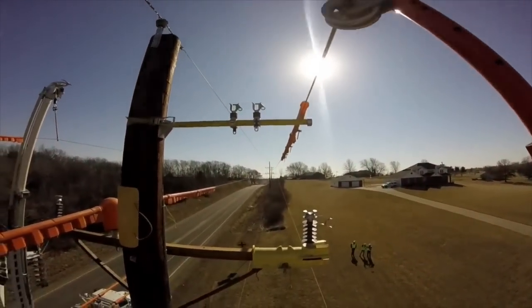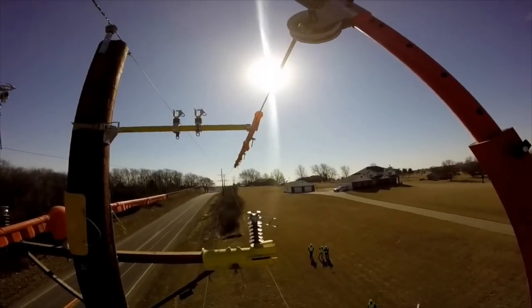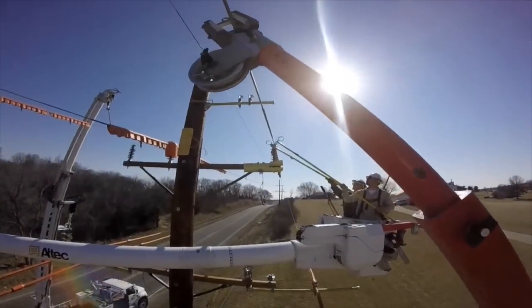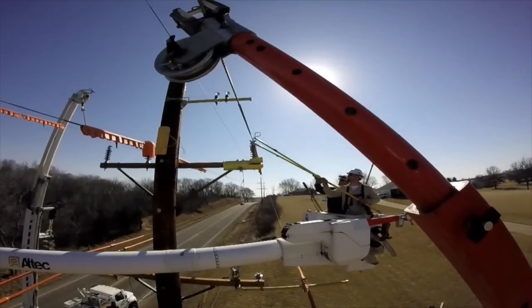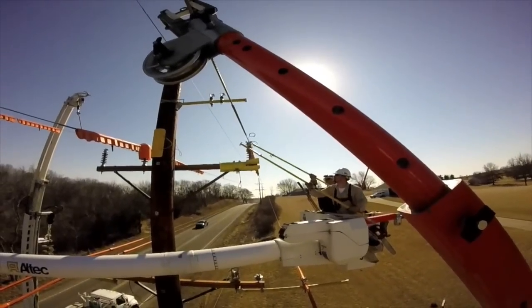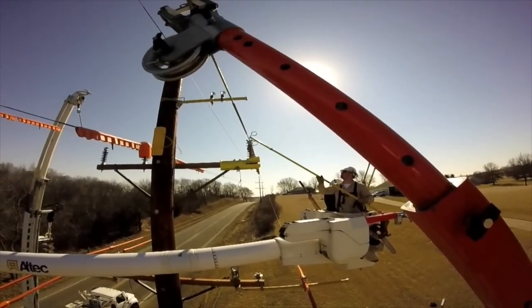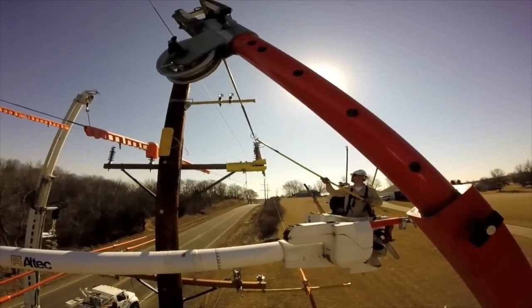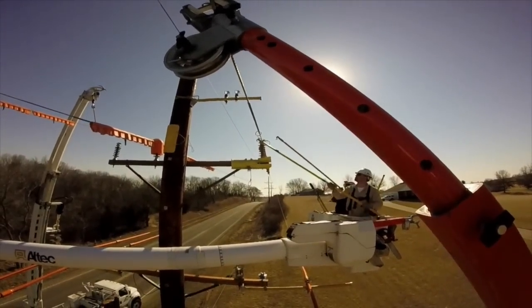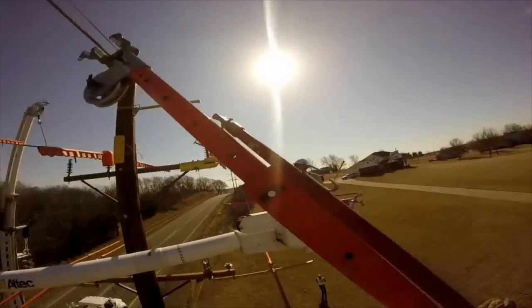You can see, looking into the sun, as they pull that line away from its temporary home on the hot arm and bring it down to the new epoxy insulator below. What's kind of interesting here is that our GoPro wearer didn't know it, but his jib is perfectly in place of the sun, so you can see beyond it and see those tie wire coils and how they're using the hot sticks to secure that line to its insulator. This is line two of three.